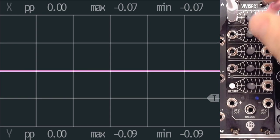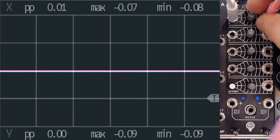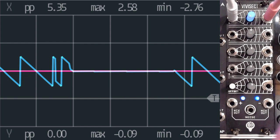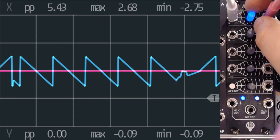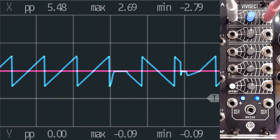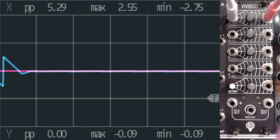Let's grab the output from that as well. Currently we're not going to see any sort of signal, because this is now in the middle. It's got a nice sensible nudge there as well, so you truly feel immediately when it's in the middle. You can go all the way to the negative side — there you go — and you can go all the way to the positive. So you'll see that right now we've got a ramp signal, and a saw signal. Very usable if you do want to use any sort of attenuated or attenuverted signals.